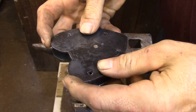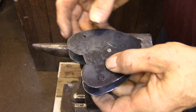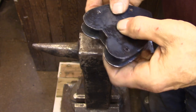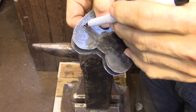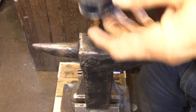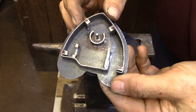The problem I'm going to have now is that the rivet blocks that I've installed into the outside band have probably twisted slightly out of position, so I can't just go ahead and file a square pin in the center of that rivet block because it won't line up. Chances are that it's moved slightly in one direction or another. So what I'm going to need to do is line everything up as closely as I can get it, then transfer the locations of these square holes onto the ends of the rivet blocks and use those marks as a guide for filing in the pins.